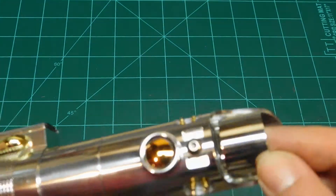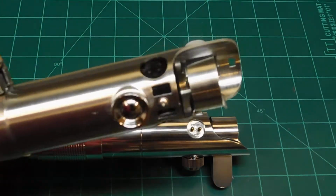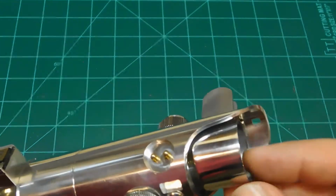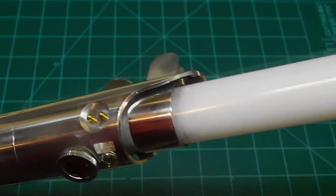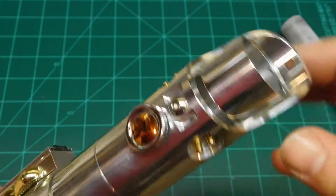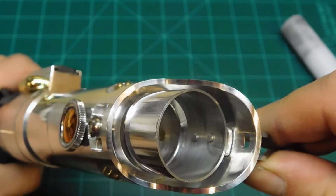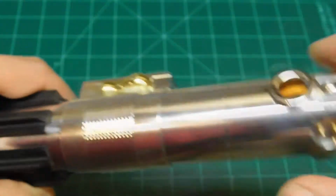So this piece here, the emitter ring, this would normally be part of the clamp on a Graflex like this. I had to hand fabricate this. This is a piece of just regular plain old aluminum tubing that I bought to use as blade holders in one of the ATS series sabers, and it turns out the inside diameter is just a little too loose, but it works great on this, as you can just drop the blade right in there, because it doesn't quite line up centered with the hole in the blade socket, and it's just held on there by the screws that hold on the bunny ears. Just barely see those right there, and a piece of another aluminum tubing that is acting as a spacer. It's not quite thick enough to get it exactly centered, so in the larger ID here it works. So that was something that was a custom touch.